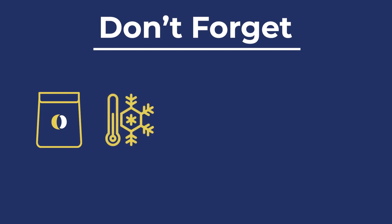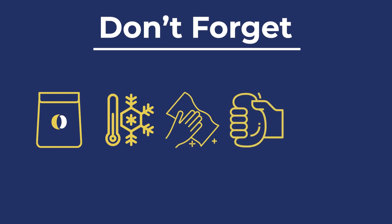During installation, keep the following in mind: use the correct size kit for the job — if you don't have the appropriate size kit, go up one size or use multiple smaller kits together. In cold weather applications, keep products in a heated truck until you're ready to install. Surface preparation is an important part of a successful repair. Use the right amount of thoroughly mixed putty — mix until it turns green with no streaks. Keep pressure sealing tape stretched to its maximum tension while wrapping directly over the putty. Do not chase the leak, and use the entire roll of tape.